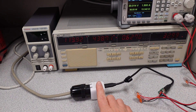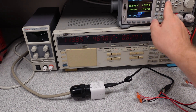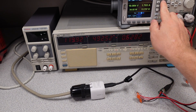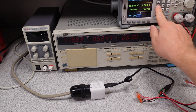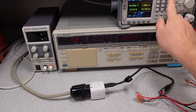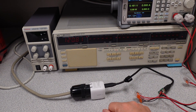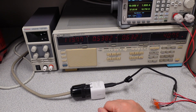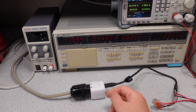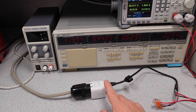It's a larger adapter, so maybe I was expecting slightly better performance. Let's see what overload is. I've got 30 watts — let's take it to 31, 32, 33, 34, 35, 36 — still going — 37, 38, and it's gone. It does recover back to the lower voltage mode, as is typical. It will go straight to 37 watts, but it's rated at 30 watts, so 30 watts seems pretty comfortable. The overload setpoint may be a little on the higher side with this one.